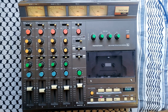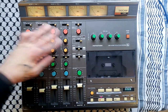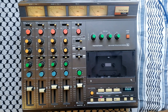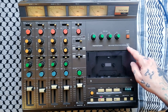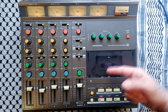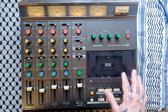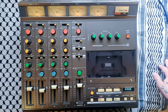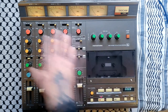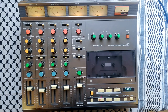Talking about close equivalents, the Teac 144 had shelving high and low EQs, whereas this has got two-band parametric — I'll go into that in more detail. I prefer these. There was Dolby B on the 144, whereas this has got DBX. I prefer the sound of DBX, but that does mean you're going to get some weird compression artifacts if you try to play back a 144 tape on this 244 or vice versa. The transport in here is a much better design from a repair perspective. The cassette player and mixer are quite a pleasure to work on — really beginner-friendly for a refurbishment project.